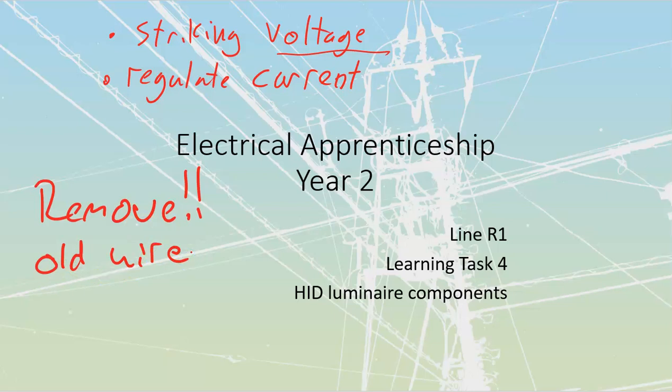You've probably gone into some fluorescent fixture at some point in your career, opened that thing up, and you can tell the thing had like five ballast changes, because there's wires cut out and other wires, and everybody just kind of marettes onto there because it's such a big rat's nest on the inside that nobody wants to deal with it. There's a problem with that.